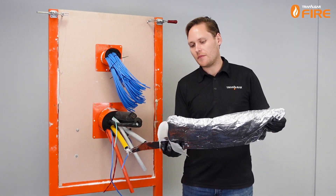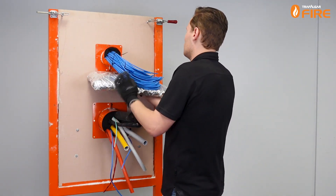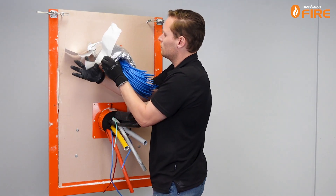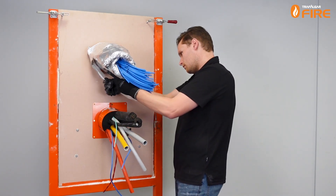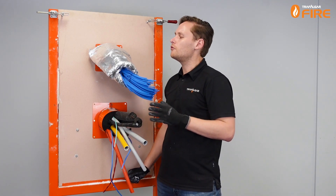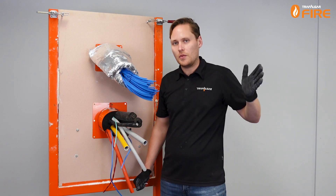I've got my piece of T-wrap that's been cut to fit. I've pre-installed some lengths of foil tape so once I wrap it around I can easily tape it in place nice and tight. We'll repeat the same thing on the other side of the wall, and to make sure this is going to stay in place for the life of the building you strap it in place with some stainless steel cable ties — just the 4.6mm wide ones, 50mm from each end, and if it's a longer piece of wrap, at 150mm centres between.